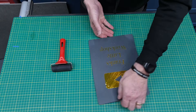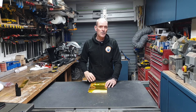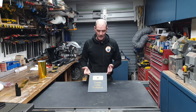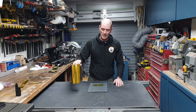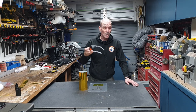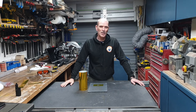Then in theory we should be able to peel this off. It's like a little monkey but you get the idea. So that's about it. The initial question was: can I cut this reflective vinyl using the diode laser? In this case I was using the Sculptfun S9 and the answer is yes you can — you can cut out letters and shapes and whatever you want. This would obviously be much better if you stuck it on straight. But just to prove the point that you can use this. Again be very careful — this is reflective, the laser is a light so it does reflect quite a bit. Make sure you've got a proper pair of laser glasses, not sunglasses — laser glasses. Thank you very much for watching and I'll see you in the next video. Bye.